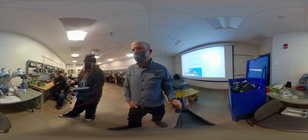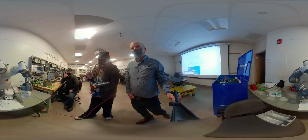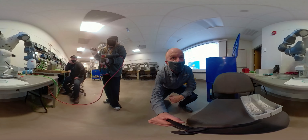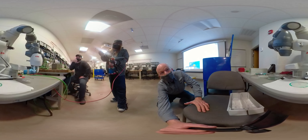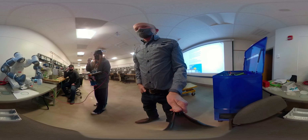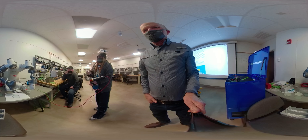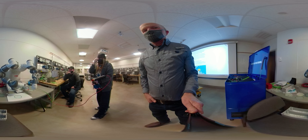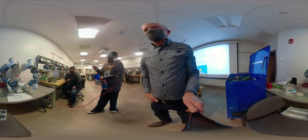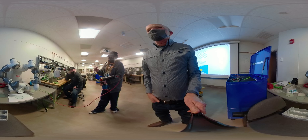Theoretically, this first hand, which is the right hand for the robot, is on our left. That has a camera on the bottom end of it. That camera will load up our job file. It will search for the part below it, which is the disc sitting right on the X there. It will move into place to pick up the part, and as it's picking up the part, it will send a message to another input, which will decide on the second hand after it's passed off where that part will go.